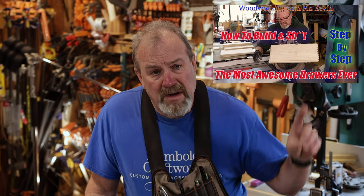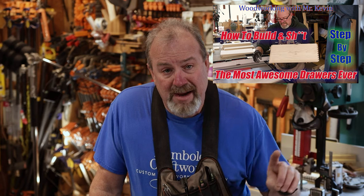So these next couple of videos are going to be about building pre-finished custom cabinets. Traditional cabinets are made by milling all the wood, assembling all the parts, building all the doors and carcasses, adding the face frames, hanging all the doors, making sure everything works, and then taking it all apart to finish it. I hate spraying the inside of cabinets, so I bought all pre-finished material: three-quarter inch pre-finished plywood for the sides, bottoms, and shelves, and quarter-inch pre-finished maple for all the drawer bottoms.